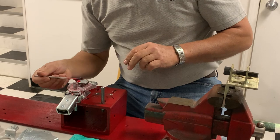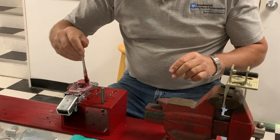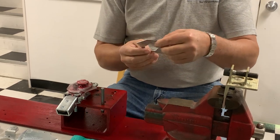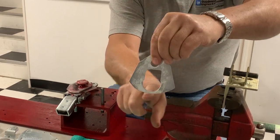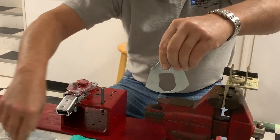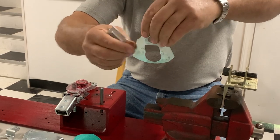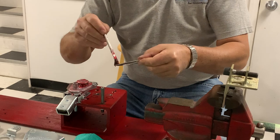At this point, with the selector pin — the mushroom part that slides between all of these — this is the perfect opportunity to make sure everything is lubricated properly. Now you've got to put the thicker shim on, and there's a little detail: as you see the bottom of the arc, this one's got a notch on it. The notch goes to the rear. You have to have the notch oriented correctly so you can put on your back plate — if you don't, the back plate won't go on the body.